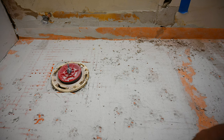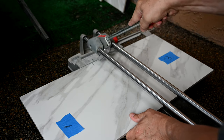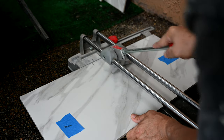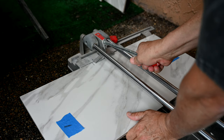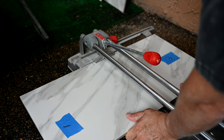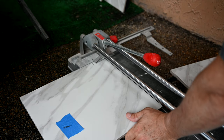It's really nothing to worry about, although it actually looks much worse than it is when you first see it. Now here you can see we're using our Ruby tile saw. We score and cut all of the straight tiles. The only time I use the wet saw is really when I need an angled cut. Now if you have really super textured tiles, sometimes these tile scoring tools don't work.